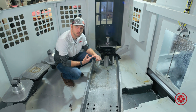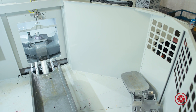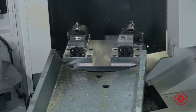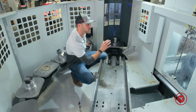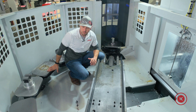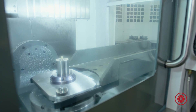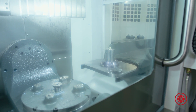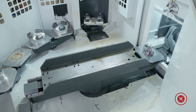The pallet pool does some of the same features — it loads and unloads systems in and out of the machine. We have eight stations, all of which we can modify and alter in any way. We can set up fixturing to run parts for our current project, and when that's done we can clear and reset the plates. The eight stations give us the ability to run the same part across all pallet stations or set up multiple different style parts on different pallets and run them as needed.